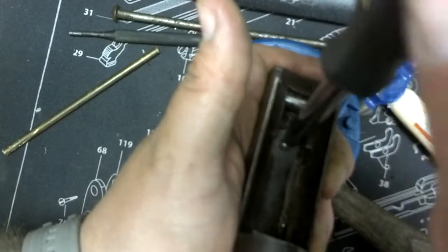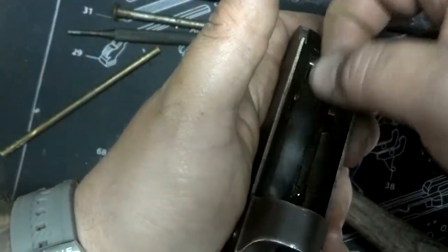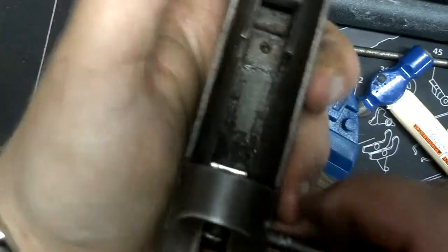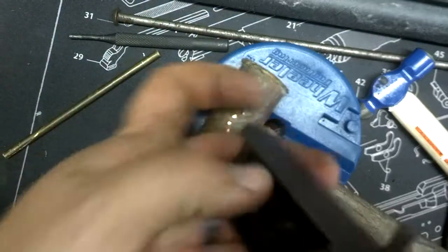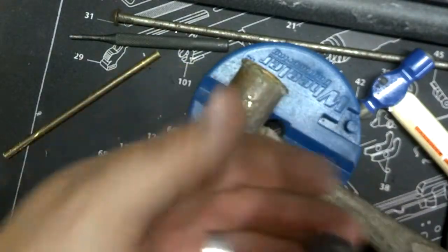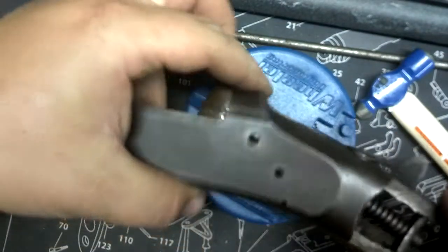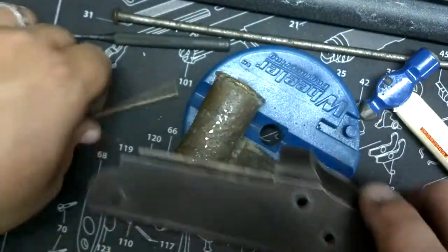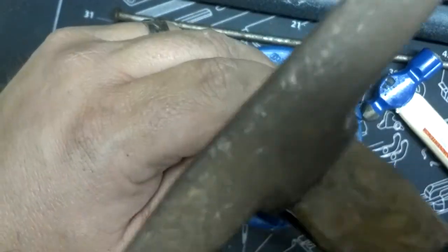You definitely don't want to booger up any of these things. Okay, spring tension release there. Pull this out. Make sure you keep hold of the spring. And then your cocking lever should come out here. Or your breech lock. Sorry, not cocking lever. Just see if we get this pin to tap the rest of the way out now.